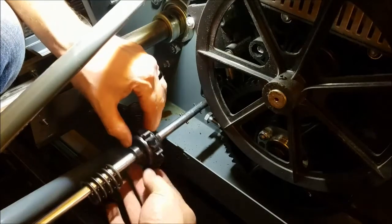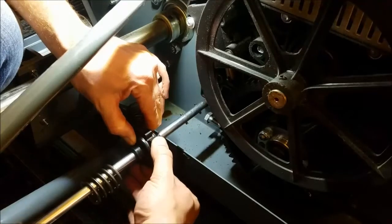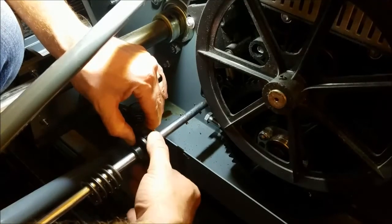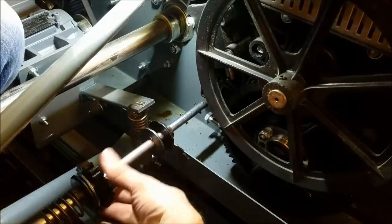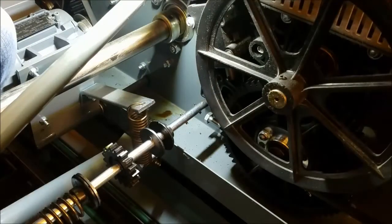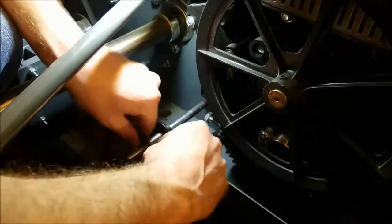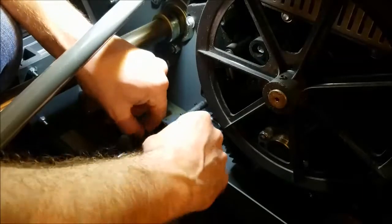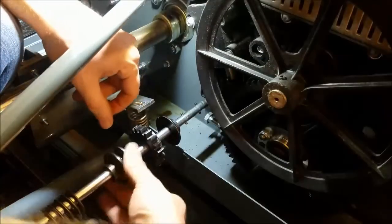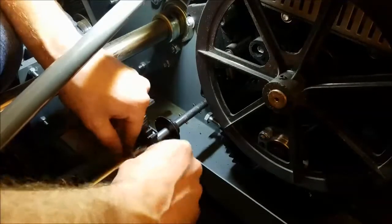Now all we need to do — as you can see, when I hold this together and put pressure on, this is not really spinning very well. So we're going to put a light film of grease on each of these two plates. Like everything on a GS machine, we want to make sure we're using non-lithium grease, because I have seen it melt plastic on old GS machines. We have people who use lithium, and you'll see — on all GS machines, just a light film of grease.